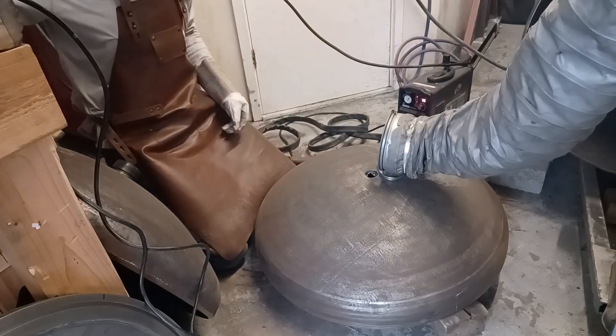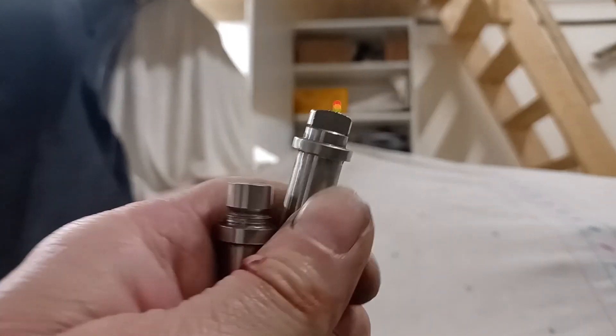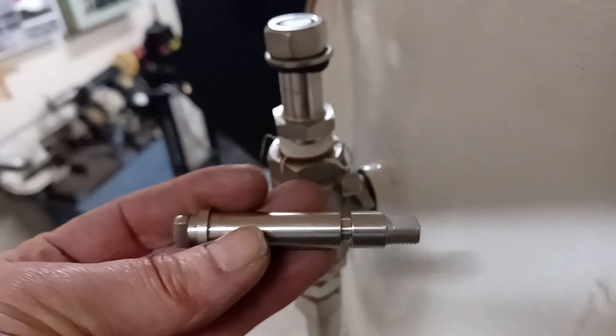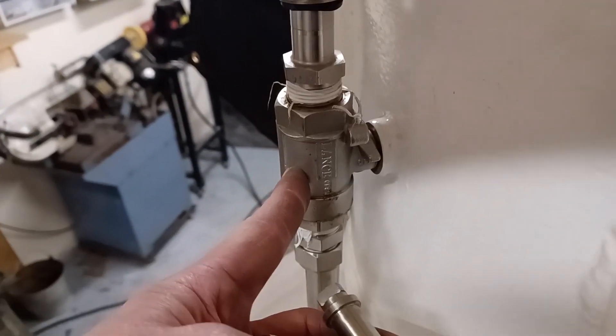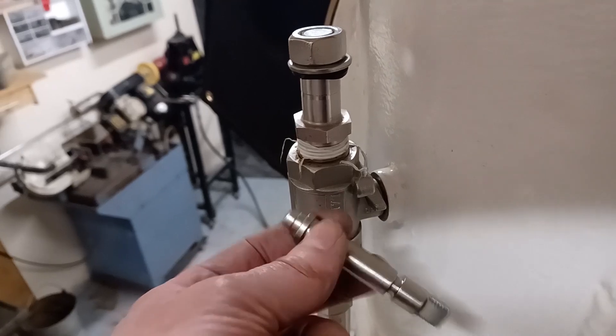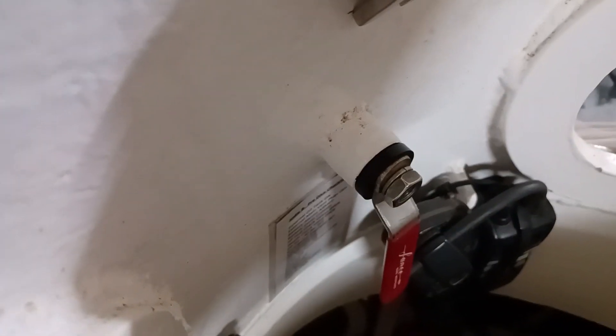At this point the microphone actually conked out so I'm just narrating this. I'm showing a different type of barrel penetrator that I think I'm going to make for the tower. That flap bit on the end engages with the ball in a ball valve - this particular one - but it doesn't have to do that, it could just pass through the hull and control anything. It attaches to a lance ball valve. On the inside, you turn the handle and it opens the valve, but it doesn't need to open a valve - it could do anything. I'm just going to put a couple of those in as auxiliaries in case I need them.